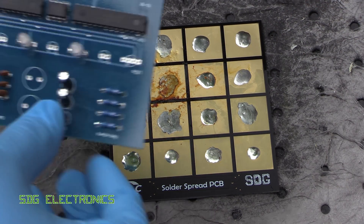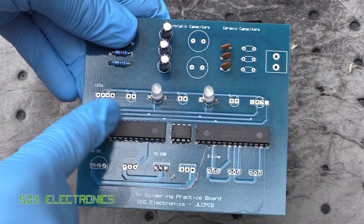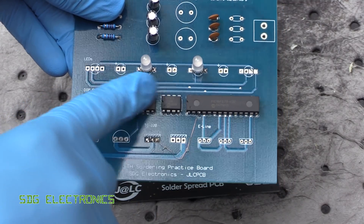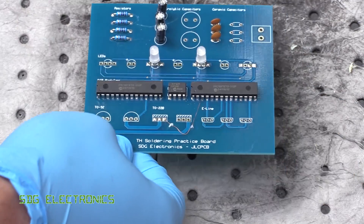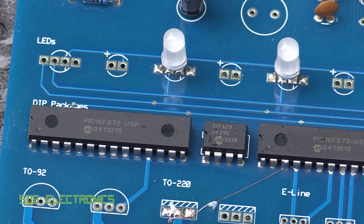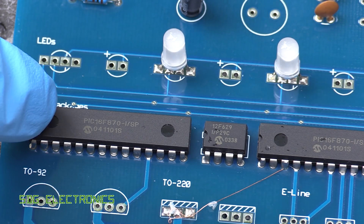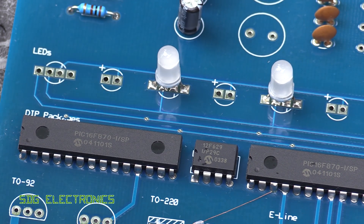What I also wanted to have a look at is on some ICs and LEDs and stuff — what would be the effect of brake cleaner, whether it starts eating away at the coating, whether you lose the ability to read the numbers on the top. So after multiple applications and quite a lot of scrubbing, you can see that the markings on the IC are completely unaffected. And there's actually been no other ill effects on the PCB. It's actually working really well. I don't know if this is specific to the Normfest brake cleaner that I'm currently using, but the results are very good and I'm not seeing any downsides.